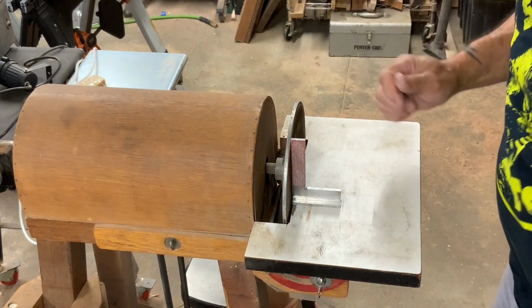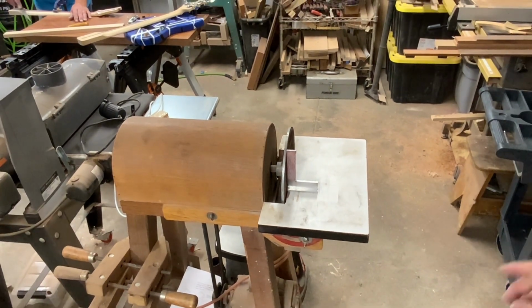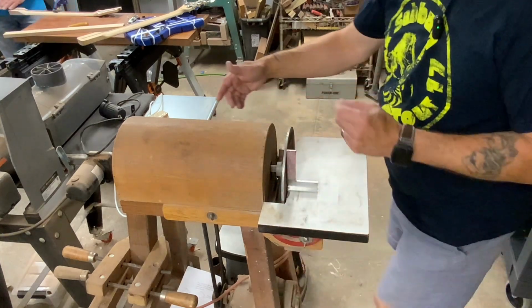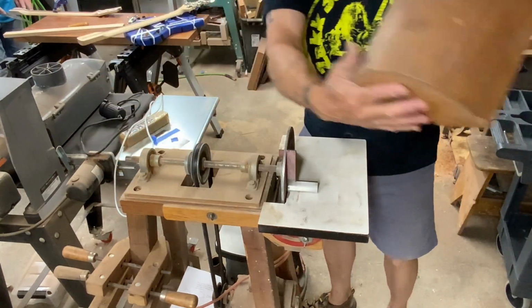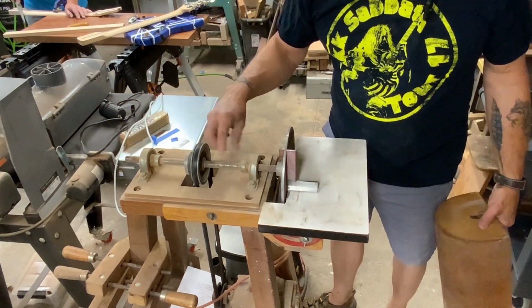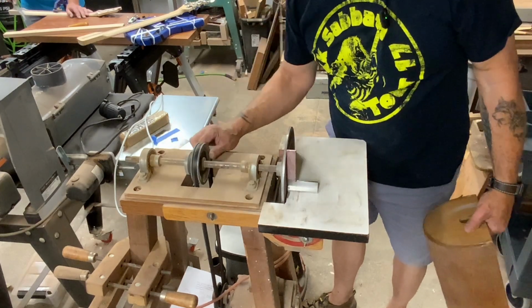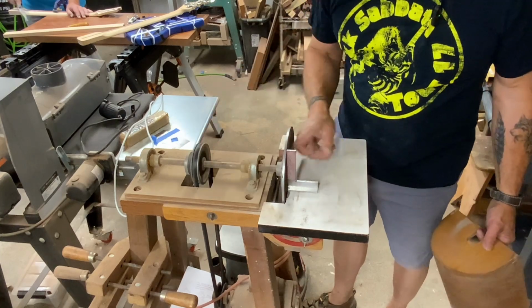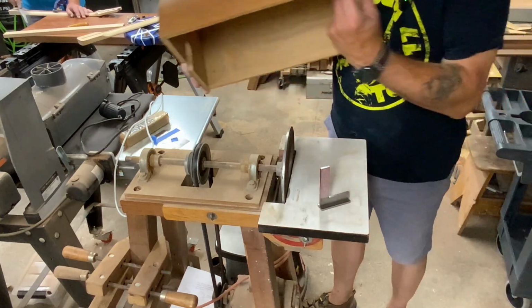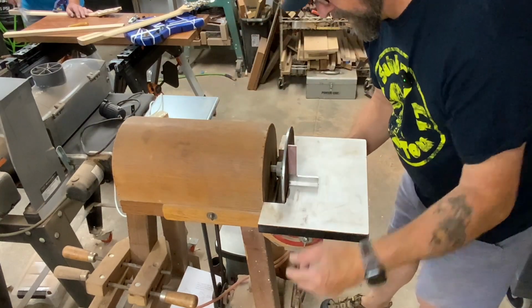This wood that it's made out of, that wood washed up on the beach. And I snagged it. And this is a piece of bender board, and all it is is a shaft and two pillow blocks, I believe they're called. They come with the bearings already in, the shaft fits in there. Shaft in the center, a pulley in the center, hooked up to a motor down below. And I just bought this disc, made this a long, long time ago. And it served me well. Done a lot of work on it.